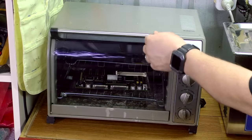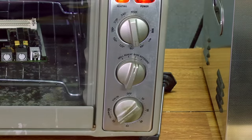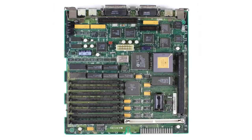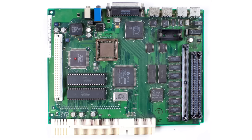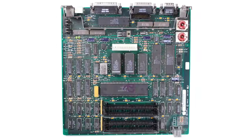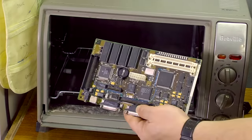I set the oven temperature at about 60 to 70 degrees Celsius, but for some boards you can go higher. Many of these vintage PCBs have plastic parts that can melt quite easily, so I'd rather go low and slow. I let the board dry for about an hour, and then once it's cooled, it's ready for use.